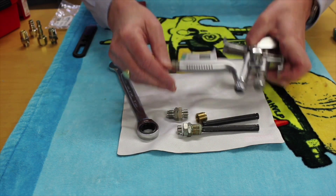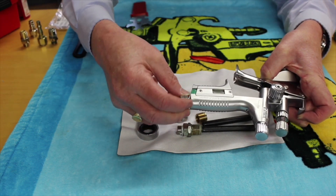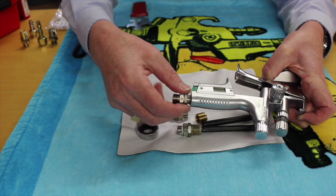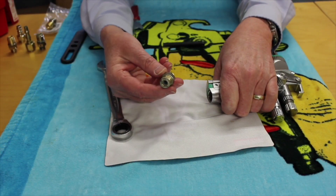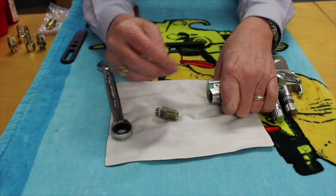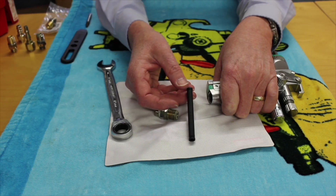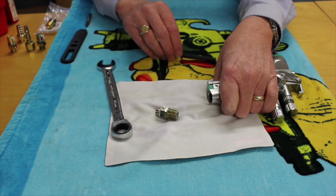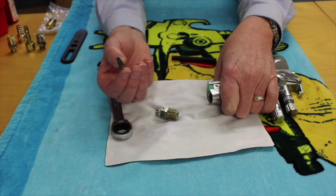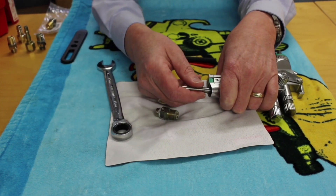What could also happen, however, is the following: as we try to remove the swivel connector from this gun — which I've already loosened — all that is removed is the swivel and the sleeve. On this example, the black pipe that goes up inside the handle didn't come out, but it's always wise to take that out when doing such a repair.